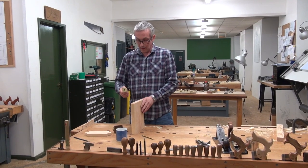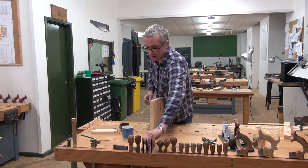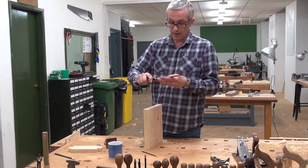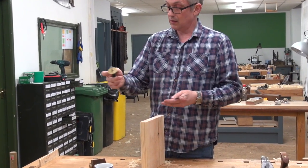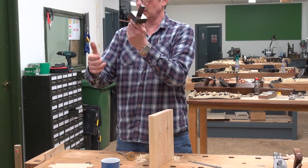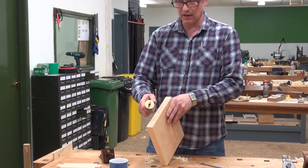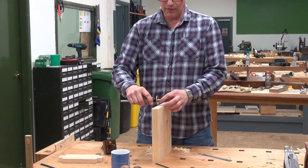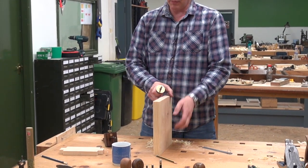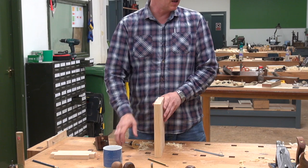If I was going to exactly 25mm, I would get my ruler and set this up to 25mm, then lock it with the knurled nut. Same process with the other one — set the point to 25mm and lock it. But that means I'm taking a lot off, so for the purposes of this exercise just find the lowest spot on your board — the point at which both sides are closest together — and take about a millimetre off that.